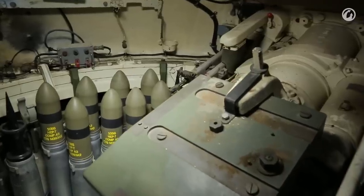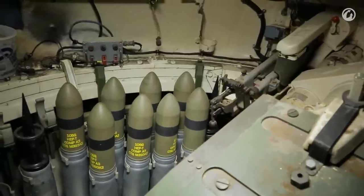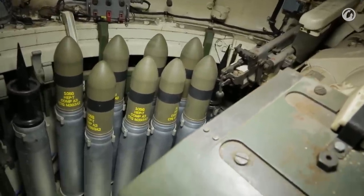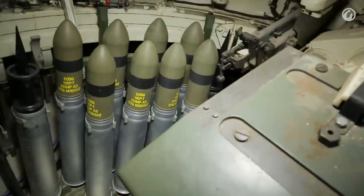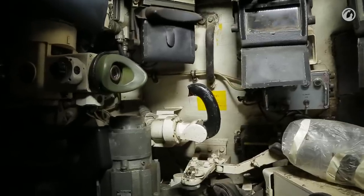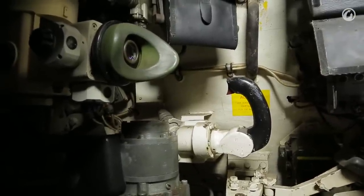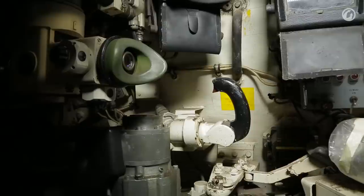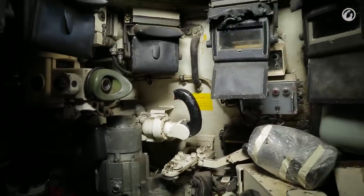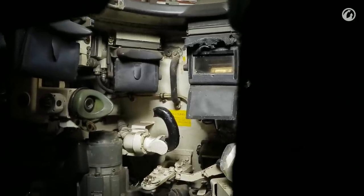Inside the tank, the loader has a fair amount of room on the left-hand side to service the 105mm cannon. There is a coaxial MG3 7.62mm machine gun as well — some users changed that out for an FN MAG, known in American service as the M240. The commander also had his own MG3 up by the cupola. On the commander's side, at his feet is the gunner, equipped with all the controls for both powered and manual engagements, with both a primary periscope sight and a direct vision sight through the mantlet.